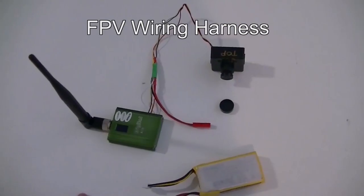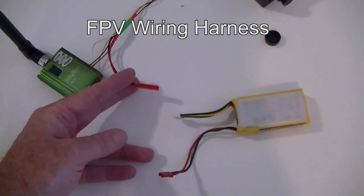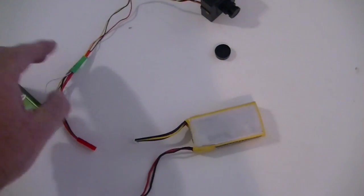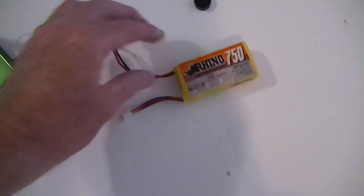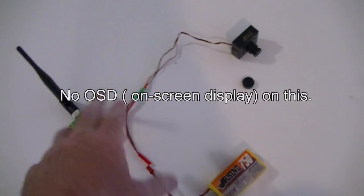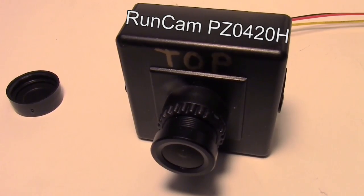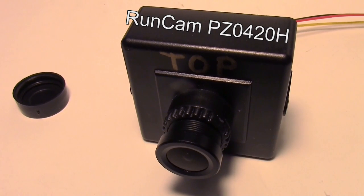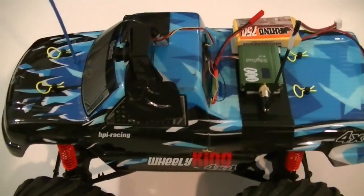I made up the cable harness — it's very simple. The red and black wires connect to the battery lead, and the video line (the yellow wire) goes straight to the camera. All the reds connect to one connector and all the blacks to another, and then the 12 volt LiPo battery just plugs in. There's no OSD because on the truck I don't really need it — it's just a simple FPV setup. We're using a board camera from RunCam, the PZ0420H, which has a plastic case, no IR filter, and is good in low light.